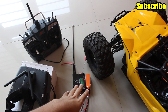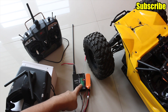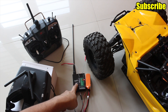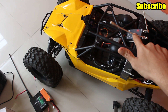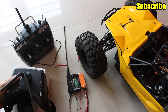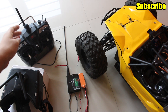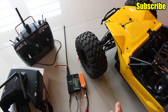With the relay system, the radio and goggles are connected through the head tracking cable, and the 2.4GHz receiver — which is bound to the radio — is connected to the UHF transmitter. All I have to do is plug in a battery which powers on the receiver, the receiver powers on the UHF transmitter, and the signal goes to the UHF receiver. As you can see, if I move my FPV goggles the servo moves. That's why I'd suggest using a radio with the trainer function to accept PPM channels from the FPV goggles — that way you get a clean setup.